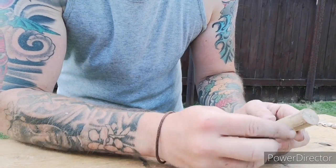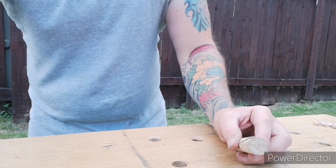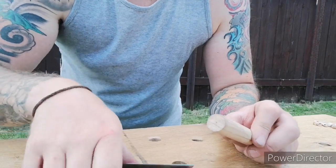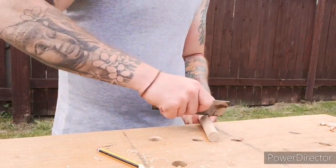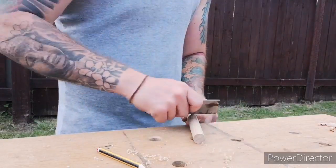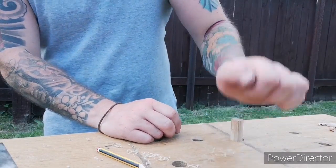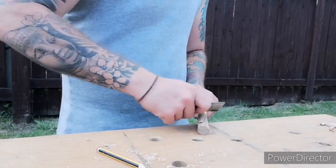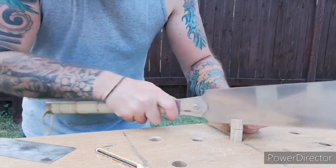Now I'm just inserting the little sliver — the wedge if you like. This can be a little bit fiddly sometimes, but this one went in pretty well. I'm just using a card scraper to push it down. You don't have to push these down very much — don't go crazy with it because you could actually split the spring part off. I'm just finishing up with a card scraper for the final fit. The dowel was still a bit stiff going in and out of the hole, so this is just trial and error going backwards and forwards. I didn't go too crazy with this because obviously with wear and tear they are going to slacken up.